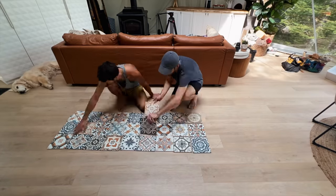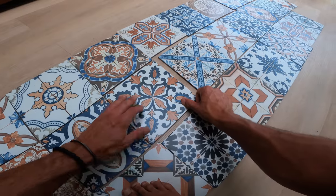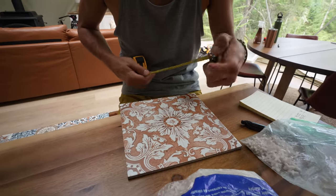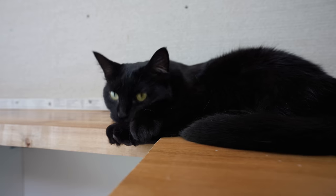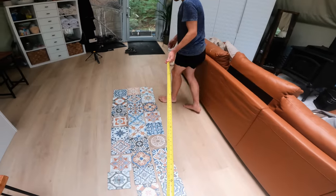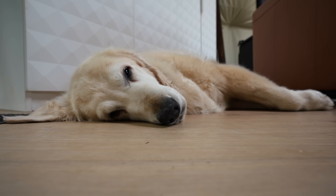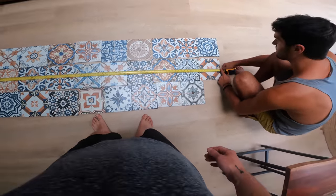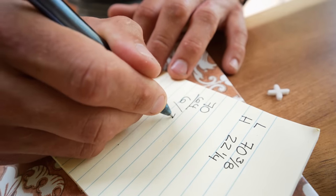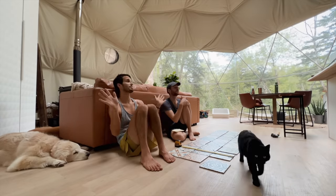There are so many solids — it's hard to figure out what goes where. We're going to go with one-eighth spacers because it brings the tiles right to an eight-inch tile, which makes the math a little easier. Just shy of six foot, so 71 and a half inches. Eight goes into 70 — eight puts us at 64, so 70 and three-eighths is right here, and then if we take off five-eighths on the other side. I should have paid attention in fractions. Like why couldn't we just do a simple white tile? Because we don't live in the suburbs.